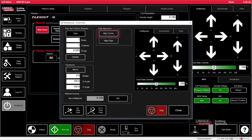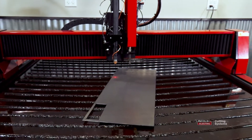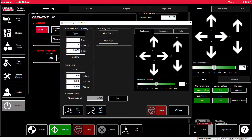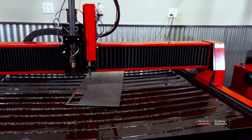We just need to be on a good, clean edge. From there, we're going to go Y positive — you never want to move Y negative — and then we'll move either the X positive or X negative direction depending on the slant of your plate. Once we get to that edge, we'll go to Align Edge. When we press that, the torch will raise all the way up and then move back down to the starting location where we started on that edge.